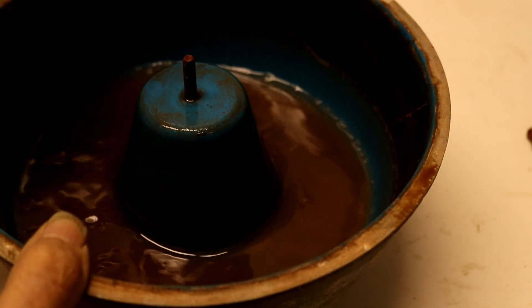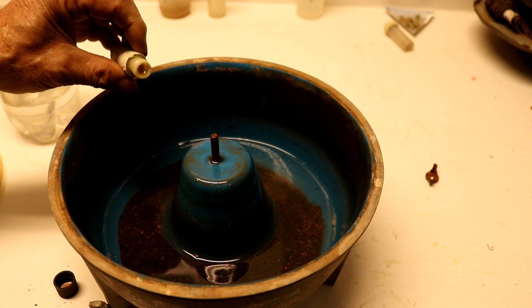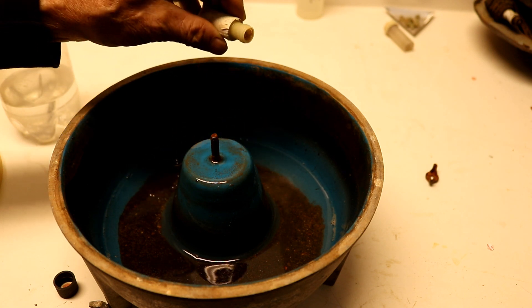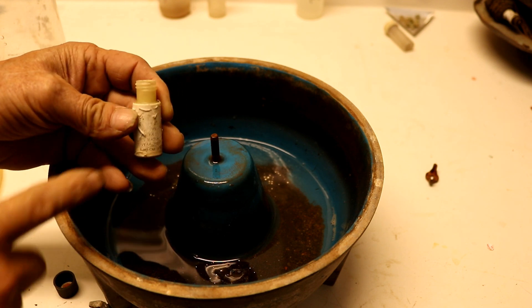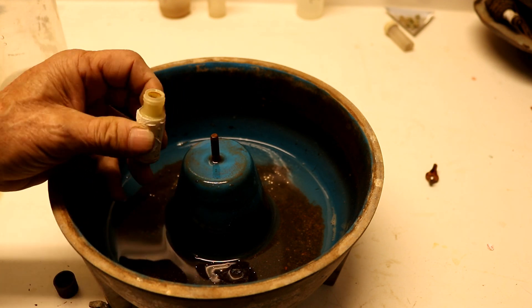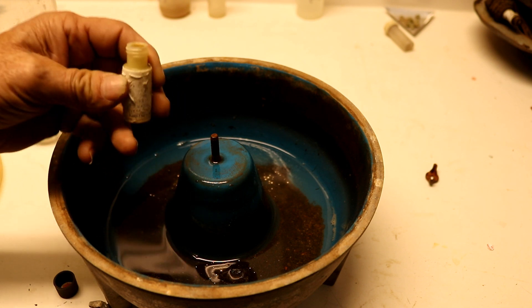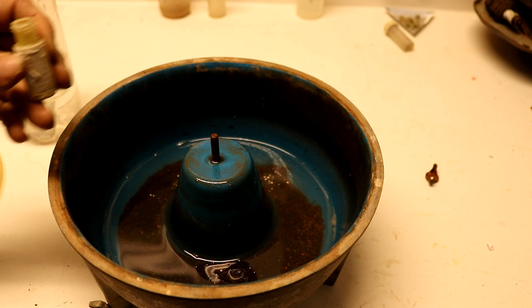It's been about four hours and this water is a lot cleaner now. At this point we're going to change the water, add our good clean water in there, and pour just a little bit of mercury in. This bottle's probably three-quarters full and I've been using it for about 30 years — you get most of your mercury back. Okay, I'm going to close her up and back on the tumbler.